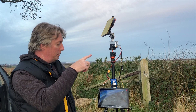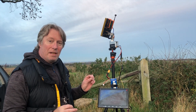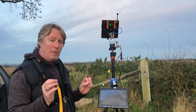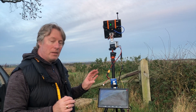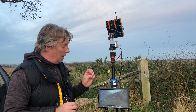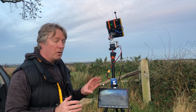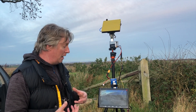The way I've got it set up at the moment is I'm just using the standard Telefly Tiny module which connects to the GPS in the plane. There's a wire from the TX of the GPS that connects into the module, which then transmits the GPS coordinates for the tracker via the VTX signal. That's probably the simplest way to set it up. I am looking to use Mavlink from the Crossfire and use Bluetooth or Wi-Fi if that's developed fairly soon.